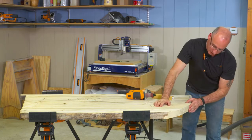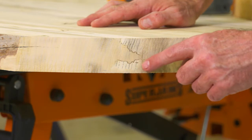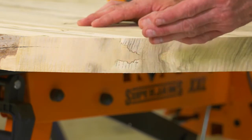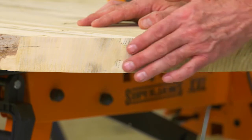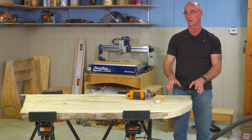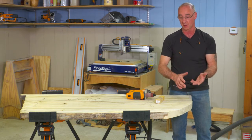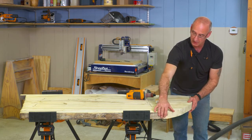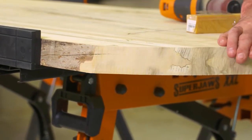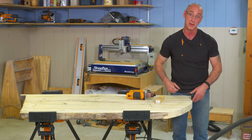It's really smoothing out nice. And one of the things that's really fun is by cutting this end off, look at the spalting that was exposed right there — it already looks neat. When we get finished on this, it's really going to help accentuate those spalting lines. Now, one of the things I like doing with these live edge slabs is not leaving the corners super sharp, because the other edges are all organic — that's the original outside of the tree. So I want to do something on each end to give this a little bit more of a natural look.